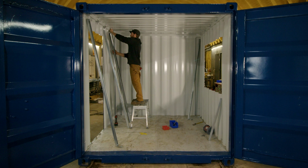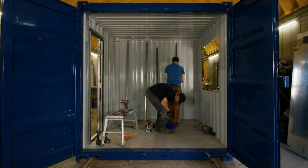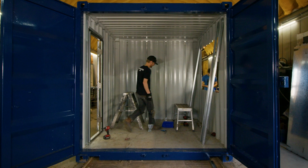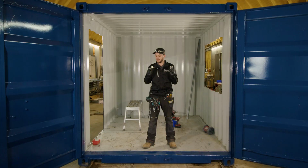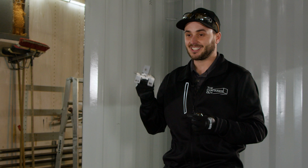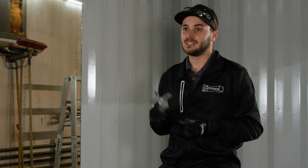These are sweet because they're very low cost. They're not sandblasted and powder coated, which is a bit of an unnecessary expense when you're already installing galvanized strut channel. These are made out of galvanized, they're laser cut with nitrogen, so all the edges are still sealed and treated. We've done water tests, stuck these things in buckets of salt to see if anything would rust. They don't, so even outdoor rated, these things are going to be great.